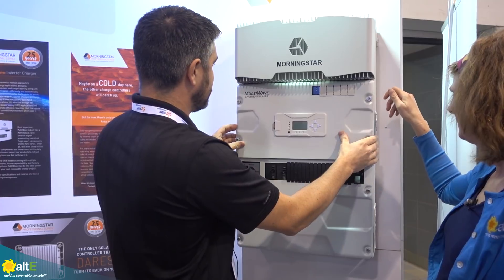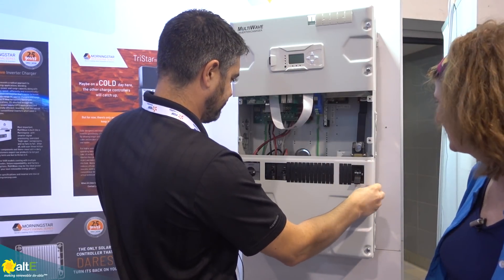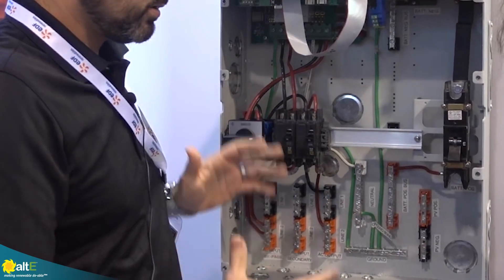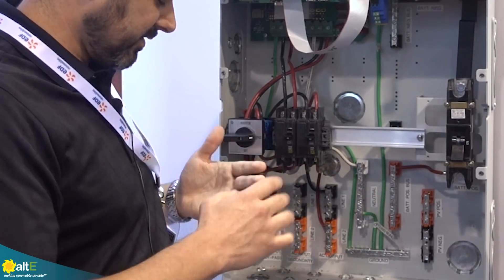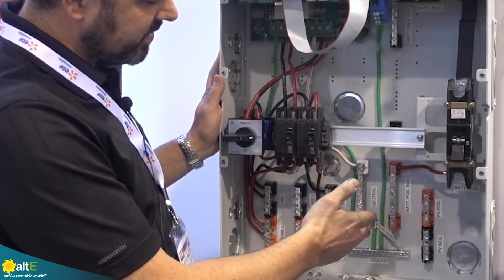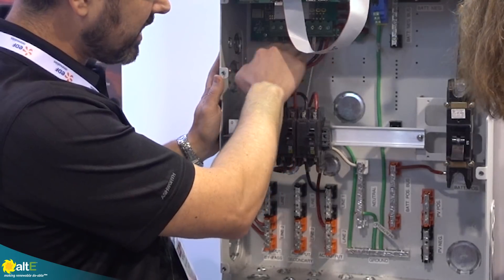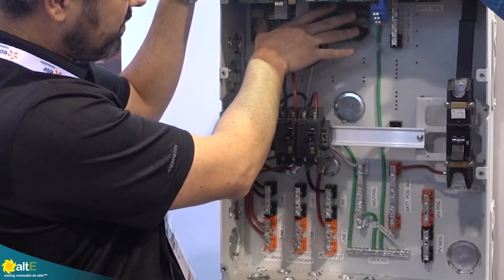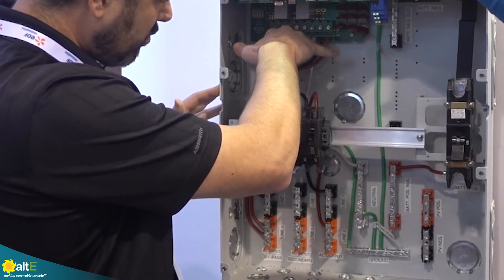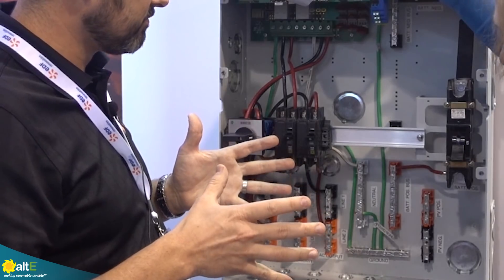So let's open her up and see inside. There are some spring clips — just hang the faceplate, which leaves the meter intact so you can still work on it if you need to. The theme here is lots of room. We did a lot of voice-of-customer research, talked to people at all levels — the number one complaint was room for wiring. So we spaced out all the bus bars that are included, giving you plenty of room for bend radiuses. There's real easy access to the relay card in the back, which is the only part we expect to be field-replaceable. Two screws pop out, remove the connections, and it slides out from the back — should be a ten-minute replacement process, five minutes if you've done it once or twice.